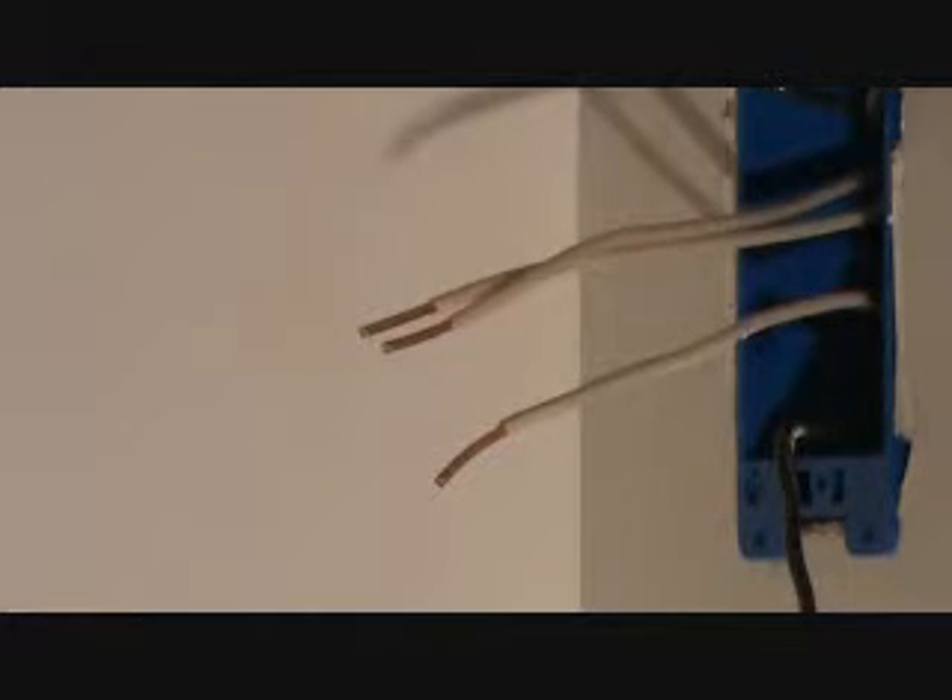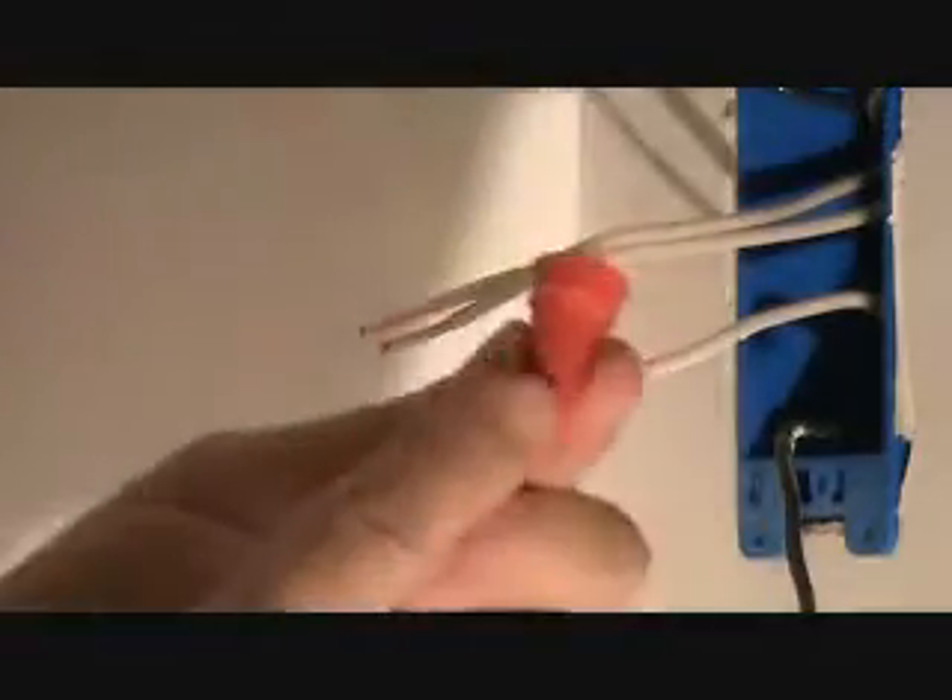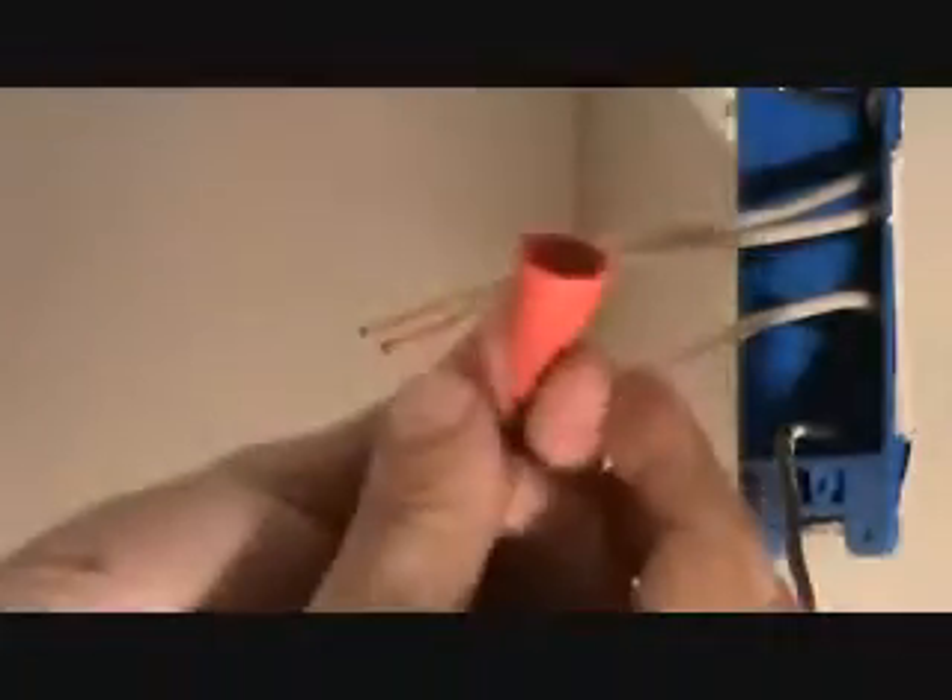There's a reason for different color wire nuts. This red one can connect three to four wires — I've even seen five wires in a red wire nut in a pinch. Now here's the thing they try to trick you at the store: this red wire nut has little tabs on the edges so you can use your thumb and finger to twist it around. But here's another red wire nut they sell that doesn't have any ears. You need really strong fingers to tighten that up, and usually I'll take a pair of pliers and twist it a little more.